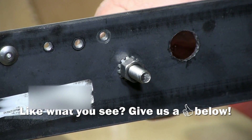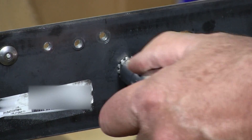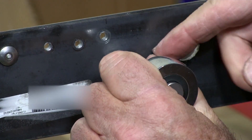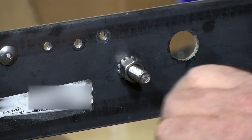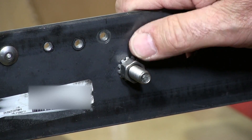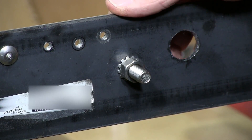If you have something that just needs to be tightened up to, it would free spin. That washer — the nut will turn but the washer will stay in its original spot, as you can see right there. The nut keeps spinning. And if you over-tighten this, it's just going to flatten out that locking mechanism on the lock washer, and it's going to become loose over time — it'll just vibrate loose.